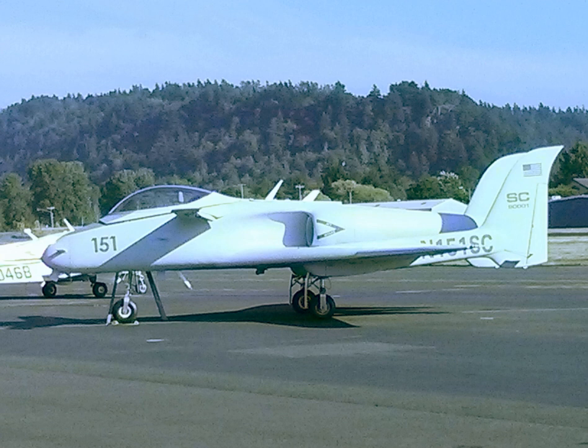This minimizes the yaw movement caused by the recoil of the gun. The aircraft fuselage is almost completely made of fiberglass composite material installed over a foam core; this fabrication technique of composite aircraft fuselages has been perfected by Scaled Composites in previous aircraft. To assure low cost and high reliability, Ares primarily includes off-the-shelf aircraft systems. The engine is the Pratt & Whitney Canada JT-15D with 2,900 lb of thrust at sea level. The hydraulic system, used for spoiler flaps and landing gear actuation, uses a Piper Malibu hydraulic pump which operates at 1,500 psi.